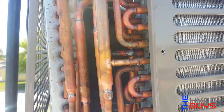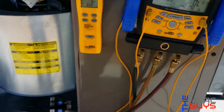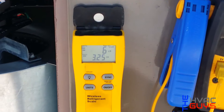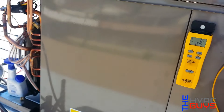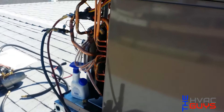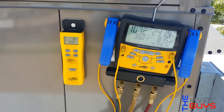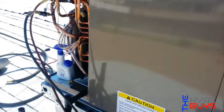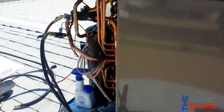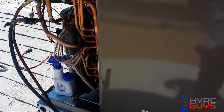I'm going to solder it right. We took it down to 500 microns. Right now we're at 6 pounds. So I just put on the disconnect — I think we have a minute delay from the thermostat. There it goes. Right now we'll hook up our clamp to check our sub-cooling and make sure it's correct, but just by weighing in the charge to go.